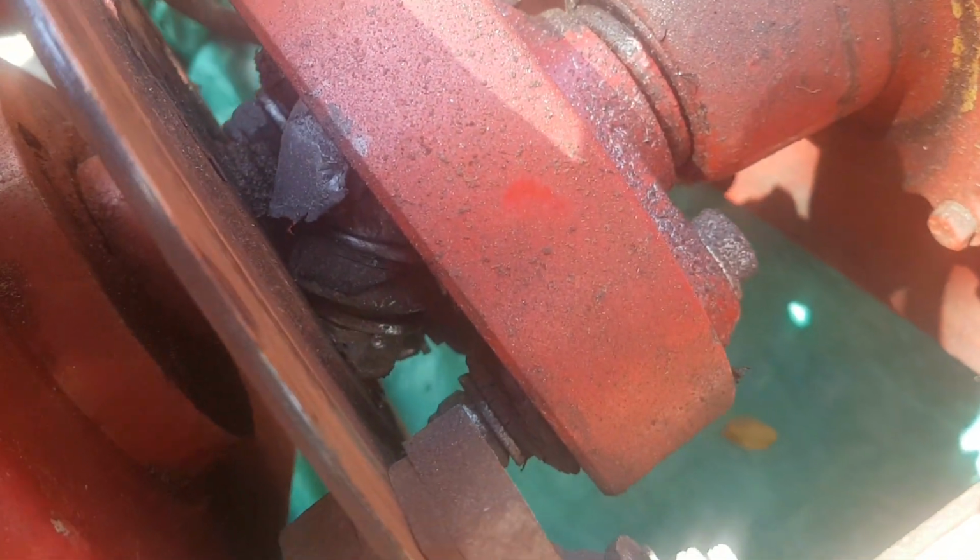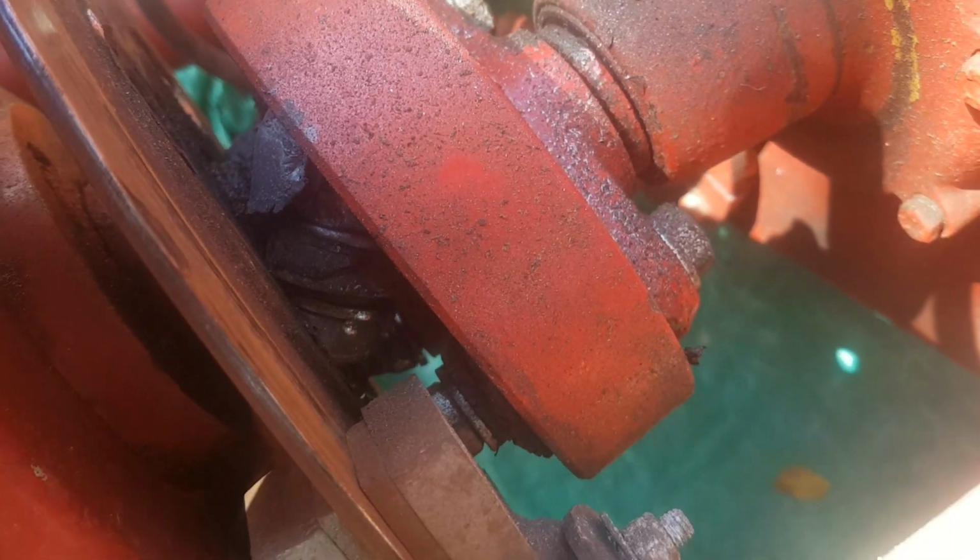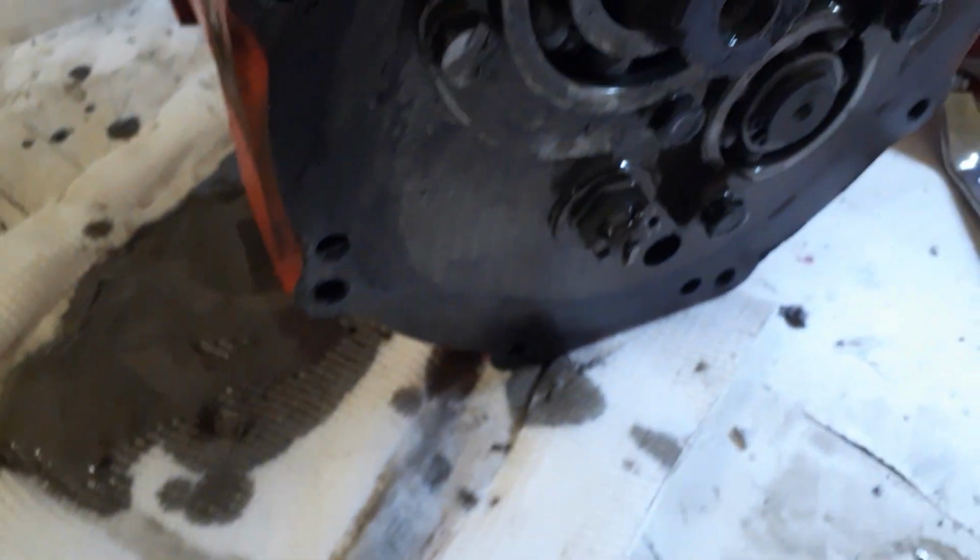So it all had to come out. The body panels came off, the engine and box came out, the box got separated, I stripped the box on the bench, and when I was getting the last of the oil out, I found these needle bearings and some other swarf in the oil. That didn't look good, and we needed to figure out what was going on there.